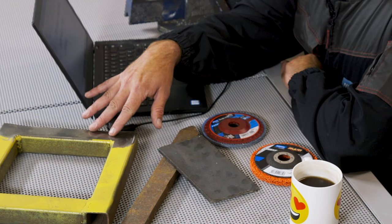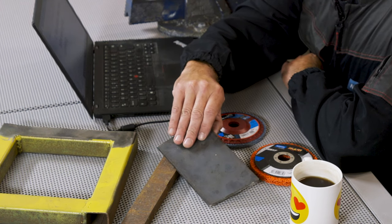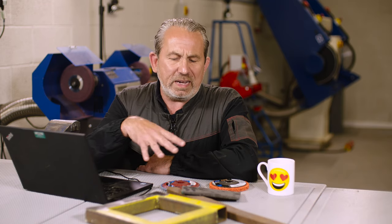Interesting question, Saul. So you obviously don't have to clean your metal before welding, but it's always advisable to do so. For a start, it makes welding easier. Look at these components in front of here — we have one with paint on the surface, one with rust on the surface, and another with scale on the surface. We could weld through that if we really tried hard, but the resulting weld will be very messy. It's hard to strike when there are contaminants on there, hard to start your weld, and it'll spatter quite badly when you're trying to weld too.